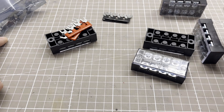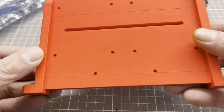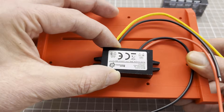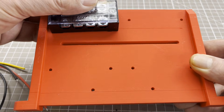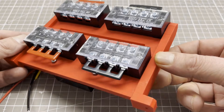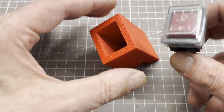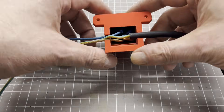The terminals shown here are used as power distributors. Since 5V are required for the control system, in addition to the 12V for the stepper motors, a DC-DC converter is necessary. The on-off switch for the mains voltage supplying the 12V 15A power supply should be able to switch the phase and neutral conductor simultaneously. In addition, the entire system must be grounded.